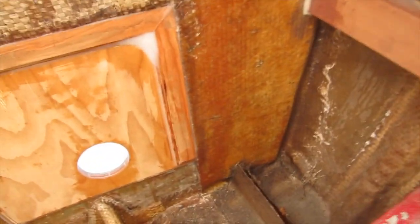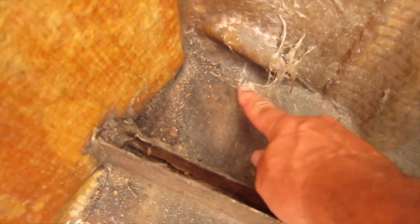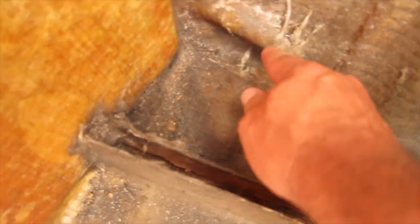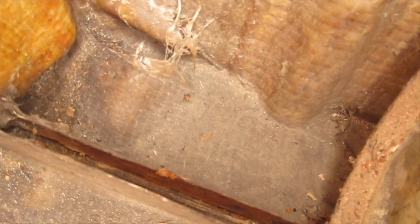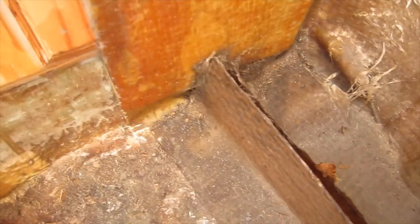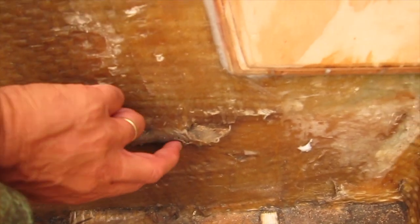But I haven't really thought too much about that yet and there's so many more things to do before I get to that. It's just really about cleaning everything up. Now this side I haven't taken the tabbing off yet — it's still sitting there, the piece just pulled right out of it. And then there's all this weird fiberglass — it's sitting above the floor and I can feel there's something under there. It's probably a piece of fiberglass. Maybe when they did this piece it was sticking up and instead of cutting it off and fixing it, they just fiberglassed over it. And then here, instead of cutting the tabbing a little shorter, they just kind of jammed it into the fuel tank.